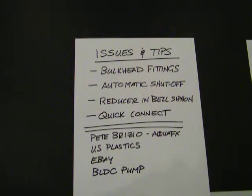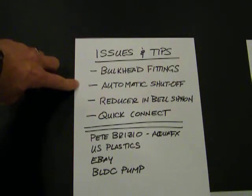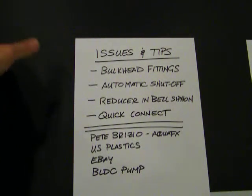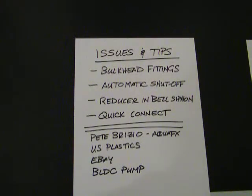Also, the automatic shutoff — I learned this the hard way. The automatic shutoff must have a check valve in it. If the check valve does not exist in front of the automatic shutoff, what will happen is that pressure will back up. When the float valve shuts it off, the pressure will bleed back through the RO membrane, the pressure will bounce, and the reject water will never really shut off — you'll have a weirdly oscillating system. If you install a check valve, that pressure will hold the shutoff valve closed until the float valve sinks, then the check valve opens and operation of the RO resumes.